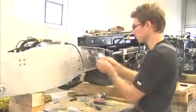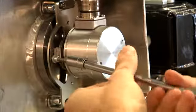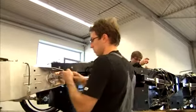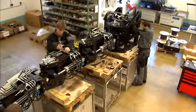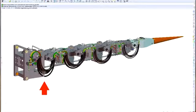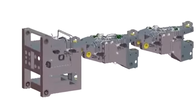The complexity of the mechatronic system is reflected also in the design of the dragon's tail, where a large number of rotary encoders and length sensors have to work perfectly together. Starting at the trunk connection, four welded sub-assemblies, each with two joint degrees of freedom, enable a high flexibility of the tail. Likewise, all supply lines of the hydraulic and electrical installations had to be planned in a suitable system and mounted appropriately.